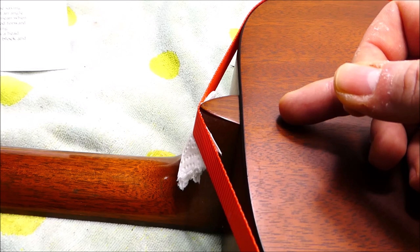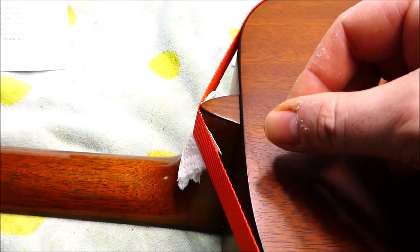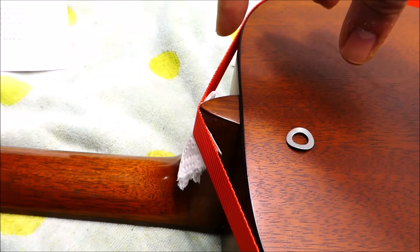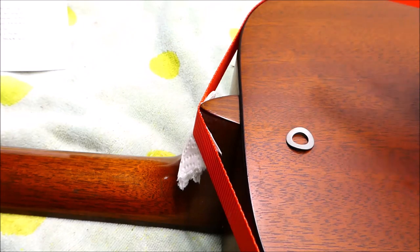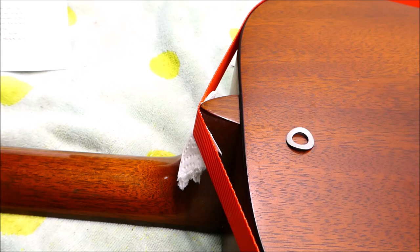In this case, the system they came up with was failing. The sad thing is the adhesives most manufacturers use are thermoplastic, and the parts can creep under tension if left in a hot car or something. If the screw became loose due to the neck block shrinking, that gap gets transferred to the outside of the guitar and the angle is ruined. This is one of the reasons I use wave washers when I do bolt-on conversions — they compress and provide constant tension against the possible contraction of the neck block. With this system, you could turn that screw until the head broke off and not solve the problem — the screw is really just a remnant of the assembly process. Once the glue is on there, it's pretty much useless.